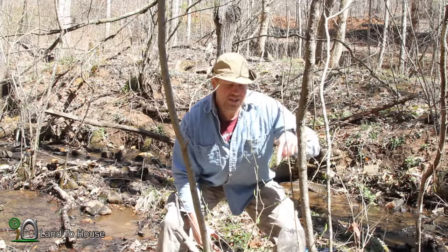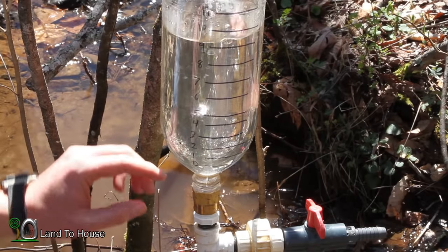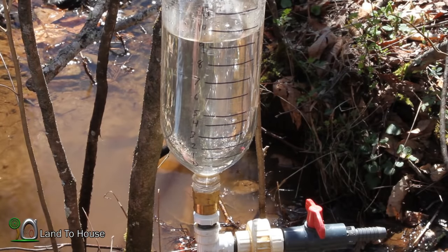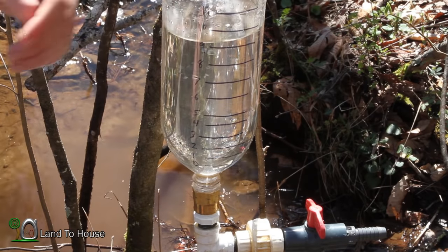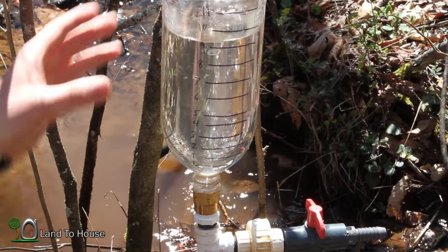Let's check out this pump. With every cycle of the pump, there's a little gulp of air that's pulled in by that tiny hole. So what this does is keeps this from becoming waterlogged over two, three, four months, a year — however long you're running your pump.